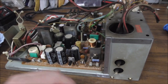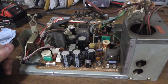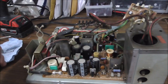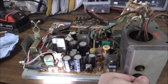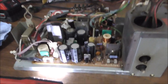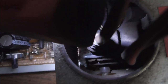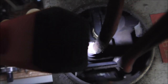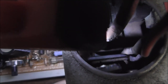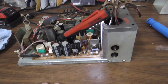While we were doing the cap kit, we found an interesting problem. Remember the screen where the flyback was turned up too bright and you could see the retrace lines? Well, the front of the flyback has completely broken off. Apparently it broke off in such a way that the thing still works — you just can't adjust the brightness. It's stuck in a medium position.